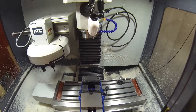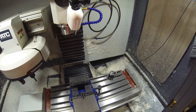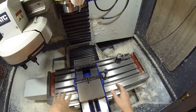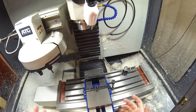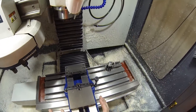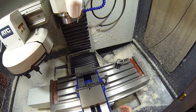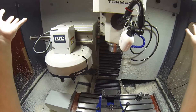Now, for those of you who've just gotten started in milling and don't really know: your coolant has oil in it, and when the coolant dries, it leaves a thin film of oil, which prevents your table from rusting, it prevents your vice from rusting, it prevents things from getting nasty in here. So if you wash down all of this with coolant, it actually helps prevent your chip tray from rusting, especially the sections of the chip tray that don't usually get coolant because they're high up.